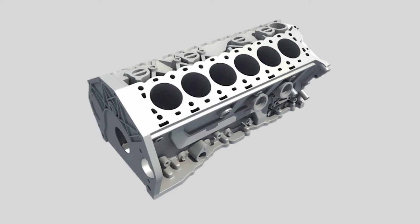So to do that, it takes a long time doing repeated shots, looking at your QQIs and making sure you have a good crosshair or a circular pattern on your QQI. Once you have that, then you can start your inspection. But here again, if you're doing parts on a continual basis, and you're thinking that you want to always start your inspection with a QQI test, even though you've done the same parts you did yesterday, you still want to start your test with a QQI check or a balancing of the field.